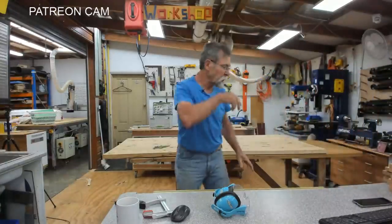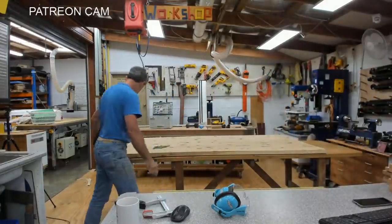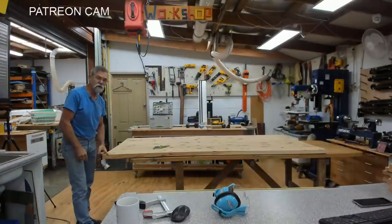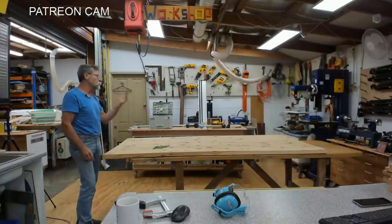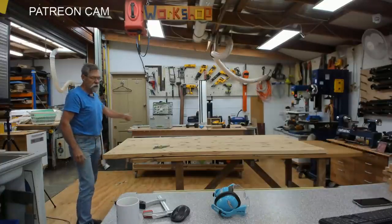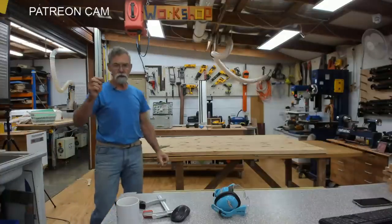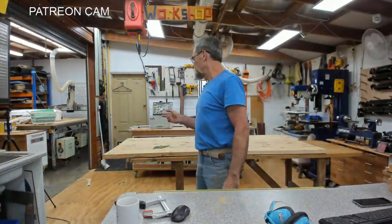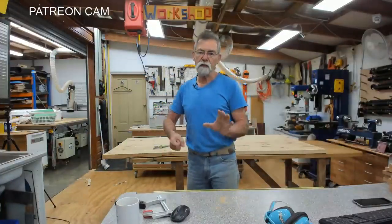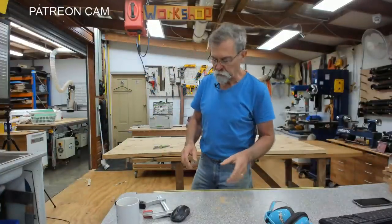Ordinarily, on the corners here, I would cut a 45 across. I'd come in 2 inches, basically 50 millimeters, and then cut across. And I would use the HKC with its own special guide rail, the FSK, and it works really well. So it'd be just zap, zap, zap, zap, and it's all done.